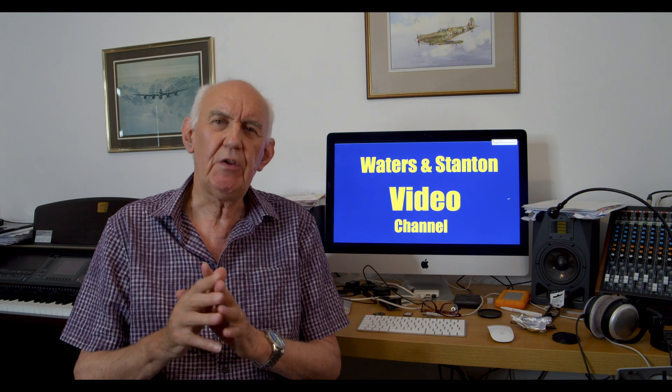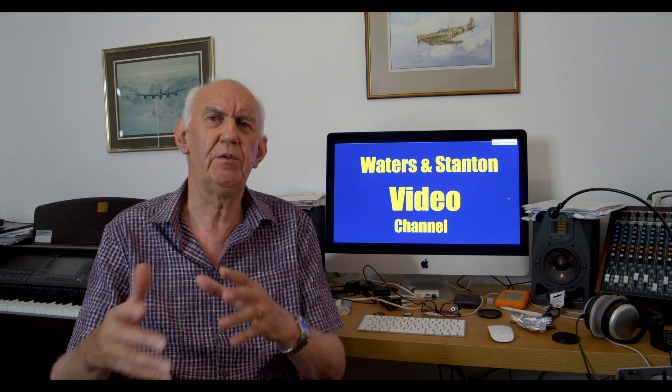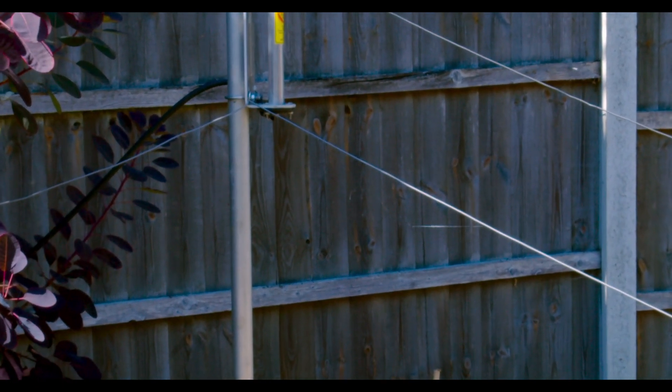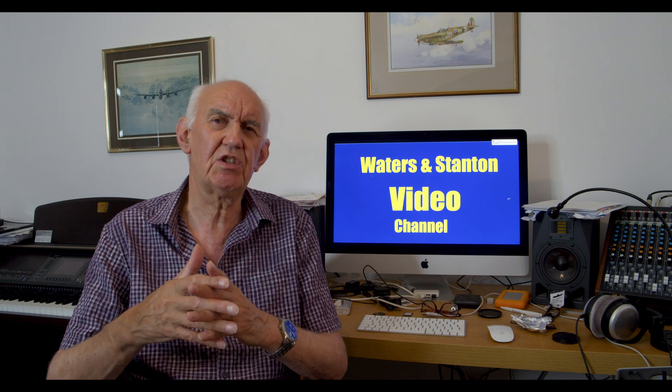I'd be interested in comments from viewers who've had experience on that. The answer is that if you've got a small garden and want to work DX, and a vertical is the answer, then seriously consider — particularly on the higher bands where it's easier — raising that vertical off the ground by one and a half to two meters. I'll show a picture here of one situation I was working with recently: the antenna was less than two meters off the ground, yet I was getting a significant gain measured over two to three months of operation — at least 6dB — meaning your 100 watt transceiver effectively becomes a 400 watt transceiver.